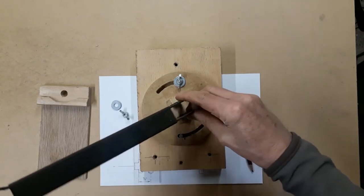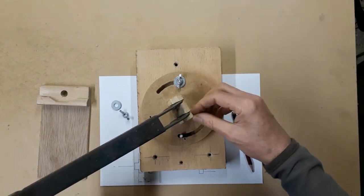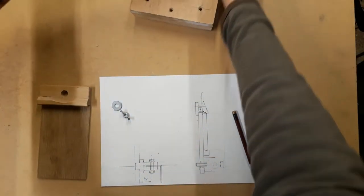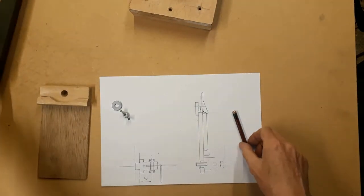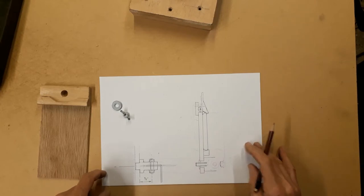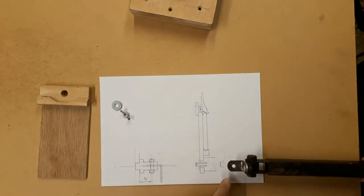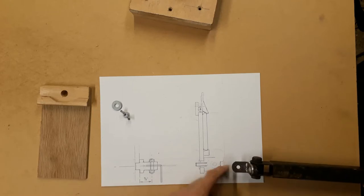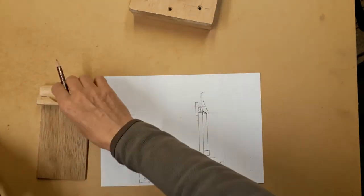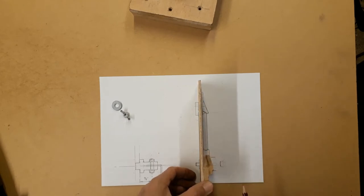The advantage of this layout is we have effectively twice the friction, because it's clamping on both sides across the outside. So that's complete. I've just produced a quick layout drawing here of the final part, which is the camera mounting. So here we have the bracket on the end there. We'll have a similar wooden clamping feature here, which will then locate in our mounting plate. So there'll be a hole there, and it will look like that.